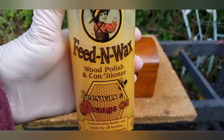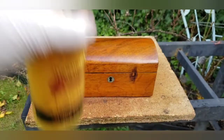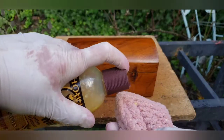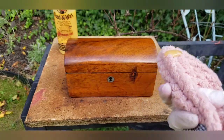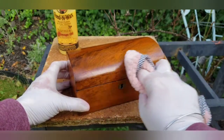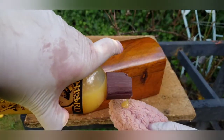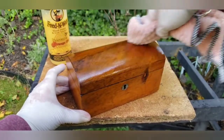Here's part two: Howard Feed and Wax — a wood polish and conditioner with beeswax and orange oil. Shake the product up really really well — it's very goopy, the consistency of orange juice. Get a rag laying around the house — any kind of rag is fine. If you want to purchase these products there'll be a link in the description below, including the same rags, steel wool pads, Feed and Wax, and Restorer Finish. Apply it in the direction of the grain — this conditions and shines your wood and beautifies it. Put it on, wait 20 minutes for it to harden, then buff it up. You can see that shine already starting to take place on the piece.